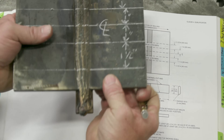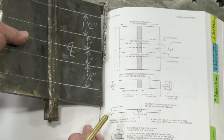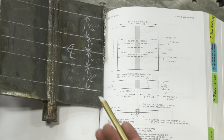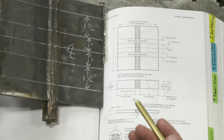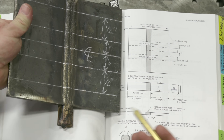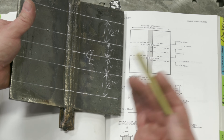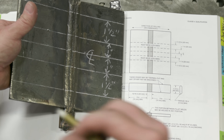Because we're doing a guided bend test, we just have a regular backing strip - this is quarter inch by one inch - and that's going to be removed for testing. A lot of people ask why you have a backing strip rather than doing open root. From my experience, it's more repeatable and it's a faster weld. There's a little bit more joint preparation, but the success of this joint has proven in structural conditions to be a lot more secure. Typically in the field, it's actually left in place in as-welded condition. The run-on and run-off tabs may be cut off and blended on the ends, but everything else is left in place - think moment connections, beam-to-beam, column splices.